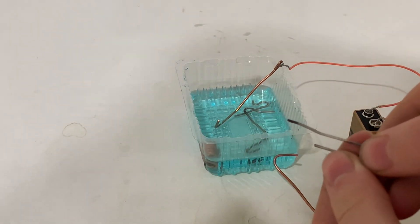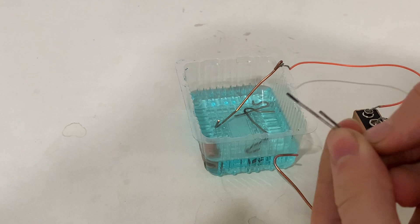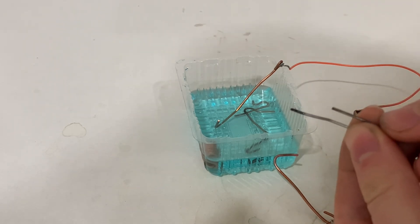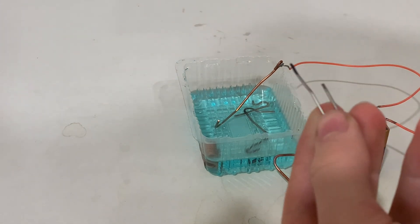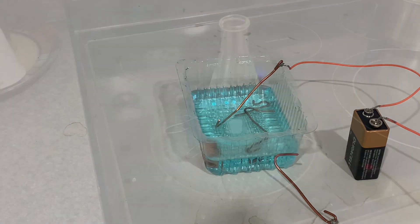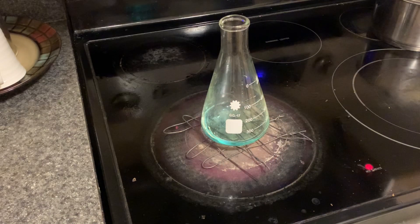If I were to take this out — as you can see, it darkened a lot. The stuff which is on it — that is not copper. This is not what you want. This occurs when the solution is not concentrated enough with copper salts. So to concentrate it right now, I would need to boil it, which is exactly what I'm going to do. Unless it's a dark blue, it's not good enough.